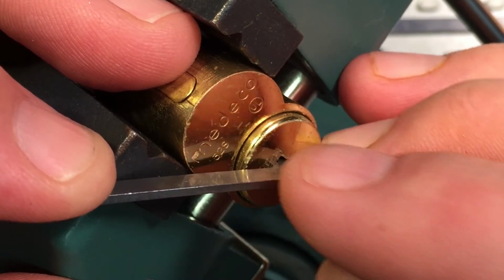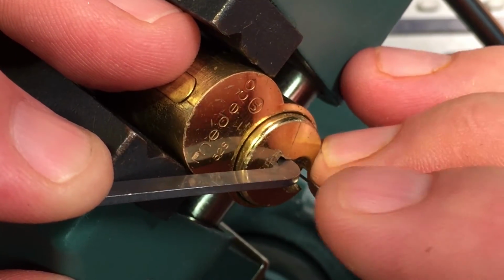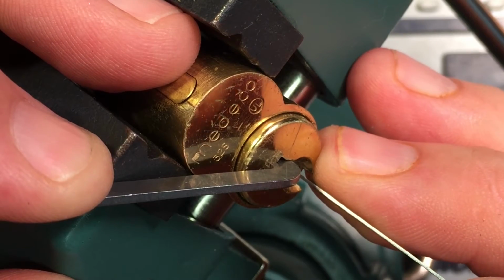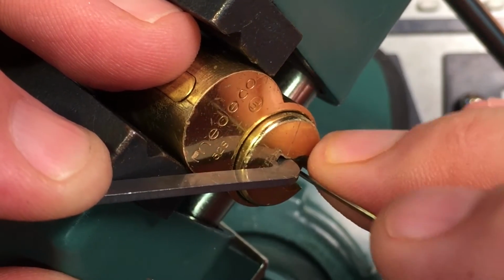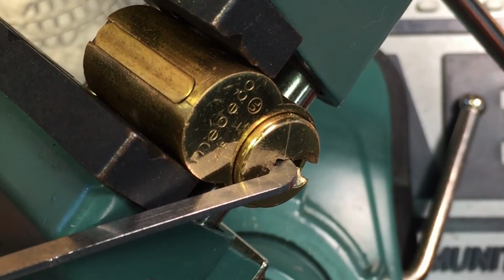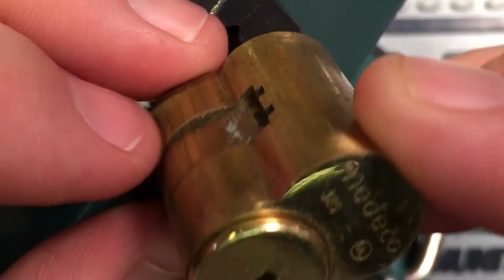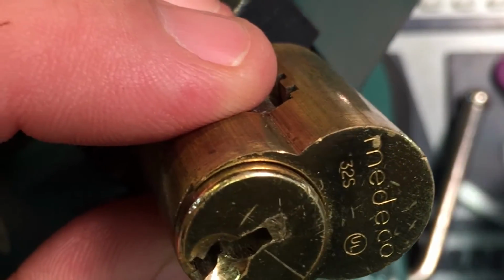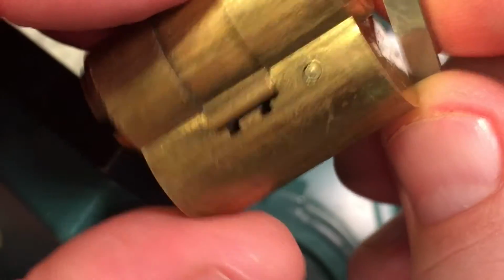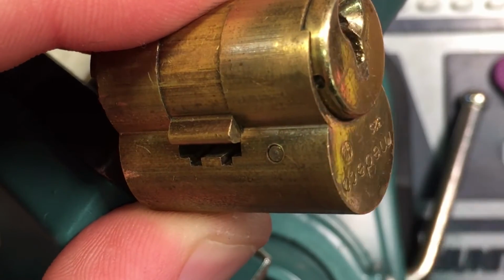So it's a matter of lifting and checking to make sure that we're still rotationally set as we do vertical setting. And I think in terms of the rotation, a lot of people kind of want to make this more difficult than it has to be. Okay, there we are at a control pick. The lock is control picked and the little nub is retracted, so the control lug, over here, is retracted, and so as we rotate this back, the control lug comes back out and everything sets.